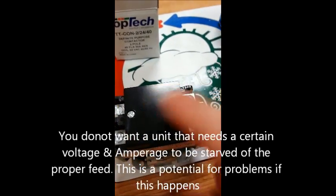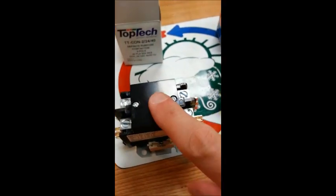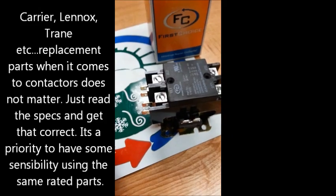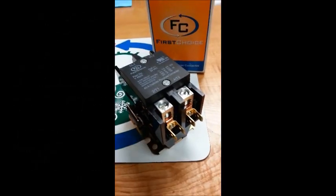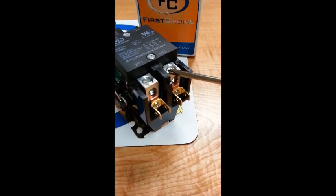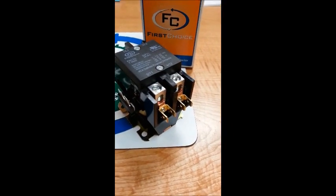As you can see, the Carrier brand replacement one does the same thing. This one can handle up to 40 amps, and so can that. Some of them are made for 30 amps — use what the manufacturer suggests for your unit. You don't have to put that kind of power through these connections, and you can always use a double pole as a single pole; that's not an issue. You can just jump right over.